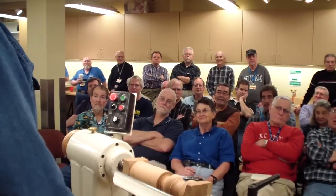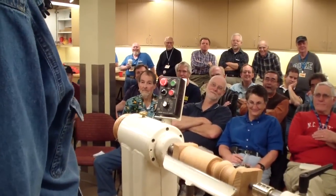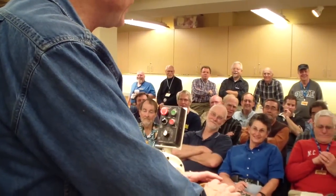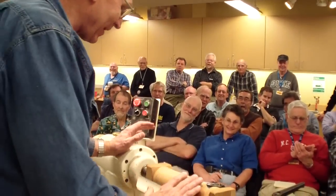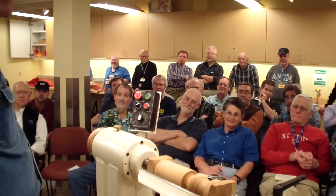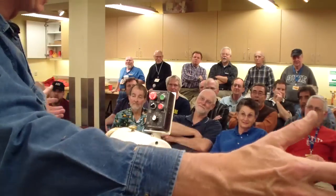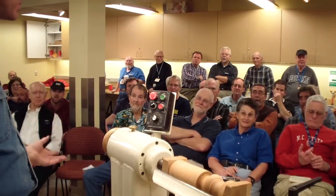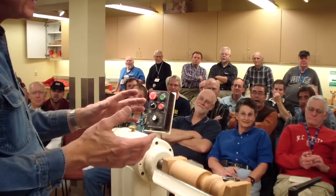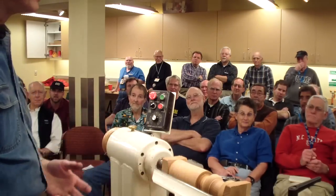Okay? I might do this again. I don't turn my lathe off. There's two ways I go about it. But I have a cable in there that's my motor that stops it. I don't just turn this thing on and hope that everything's set up right. I disengage the clutch just like my car, turn it on, and then ease in. If it's out of balance, I step on the clutch and turn it off. If it's good, I don't.